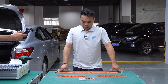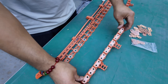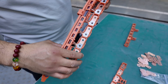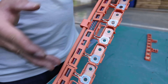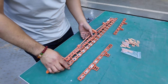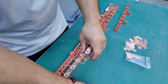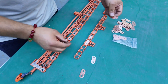In this next step I'll demonstrate how to replace the bus bars. This is the one toward the backside and these are the ones on the front. Normally these bus bars get corroded and need to be replaced if there's a lot of leakage from the old battery — if you don't replace them they are going to cause issues for the new battery. The trick is to stick your finger on the very back end and push up — it comes out. Same thing: push up and out, then put the new one in.